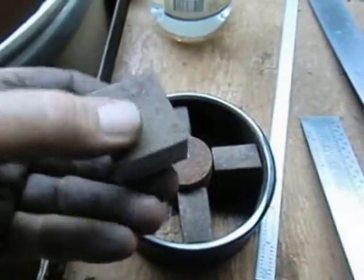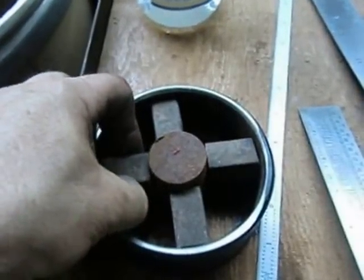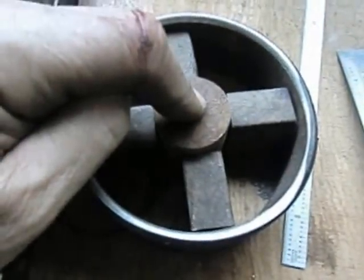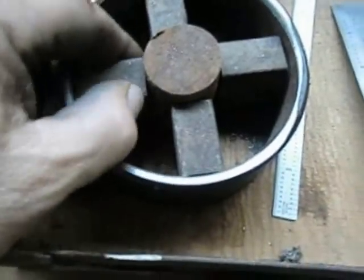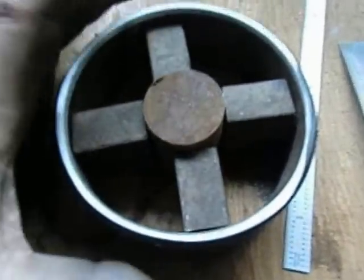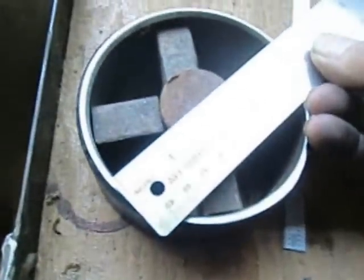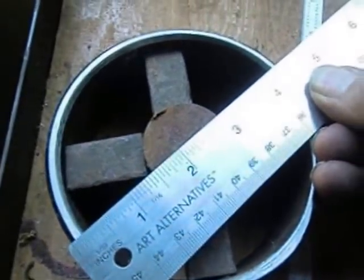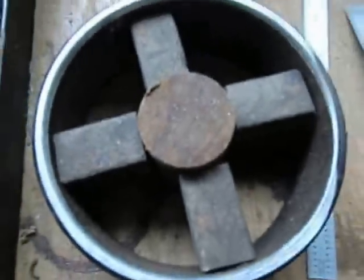We've cut these little plugs and slid them in. Now it's going to go in just on the other side of that, and we'll have ourselves a nice support system for a hole right through the center here. Once that happens, we can machine it off and make sure our hole is squared up. I'll have another die one size larger. This one is going to be a four and a half inch — probably by the time we get the spring back out of the piece, it'll be a four and a half inch die, which is pretty much what we wanted.